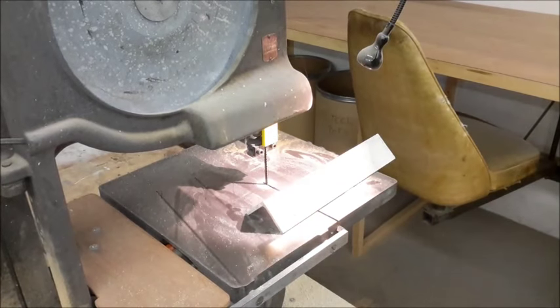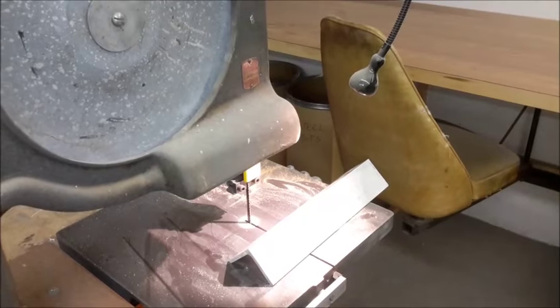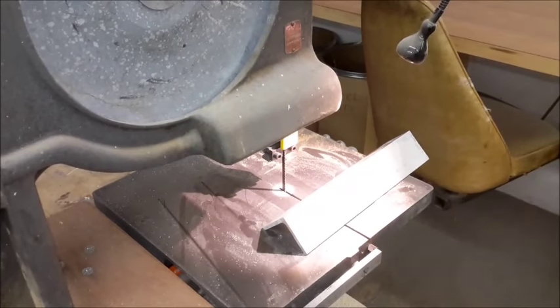And when you cut aluminum, it cuts fine, it cuts nice, in fact, but you only feed as fast, just like anything else, you only feed as fast as it's cutting, especially with metal. You start pushing it too fast, and things happen, and you don't want to have those things happen. So here we go, the cutest bandsaw ever.